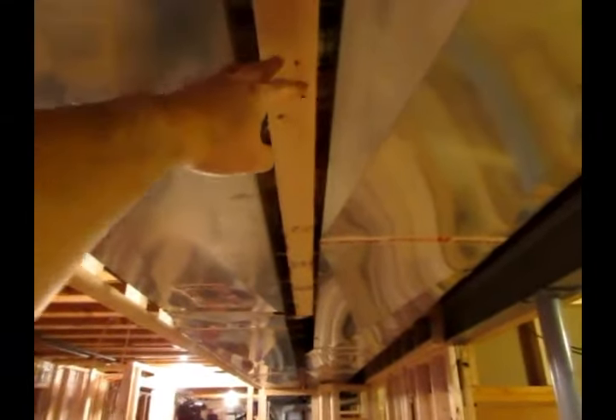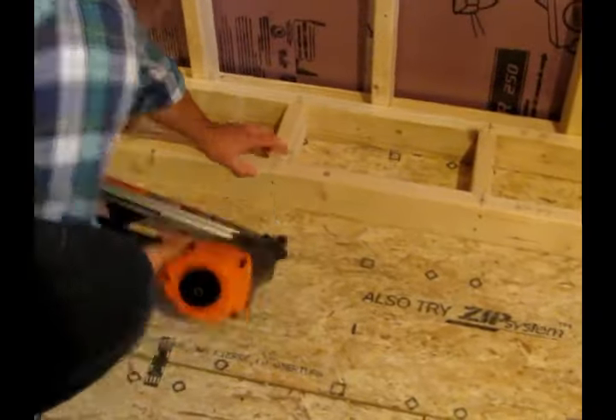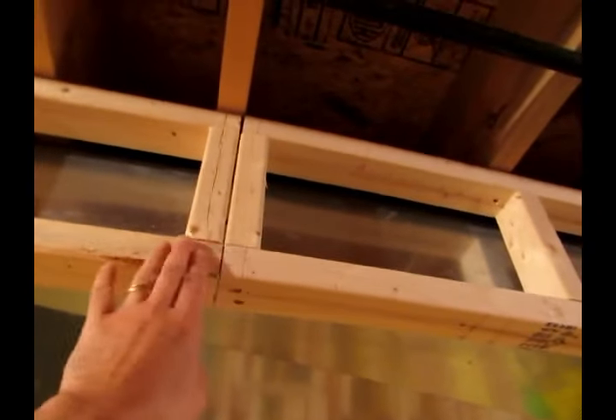In here it's actually pretty narrow. We've got a wider space to work with here, so it wasn't too much of a problem getting this ladder up in there. But over here you can see it's going to get narrower. So in this case I had to basically pre-build half ladders, secure them up into the joists above, and then put the bottom plate up against these after the fact. These ladders I pre-built on the floor, then simply lifted them up, put them in place, and secured them to the joists above. I made sure I had these ends flush, and then nailed or screwed them in together.